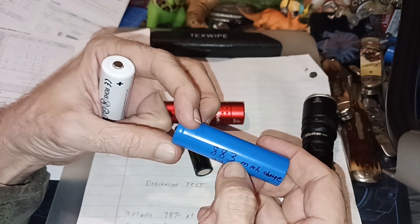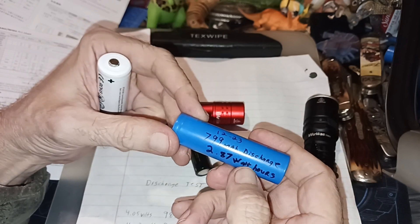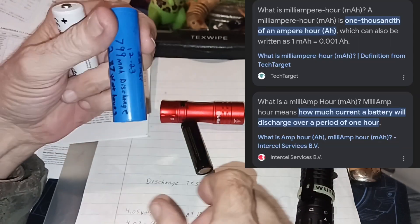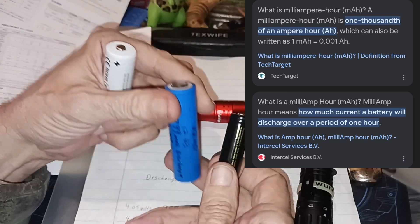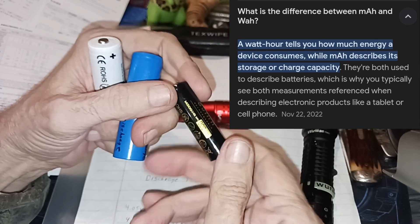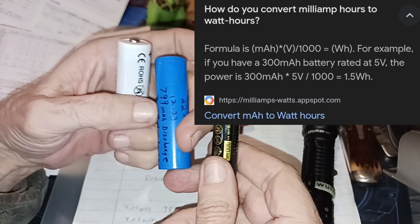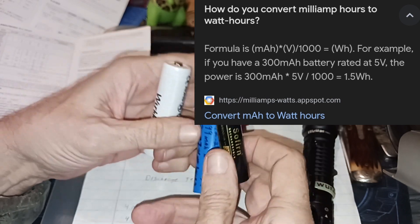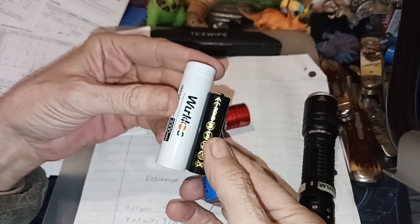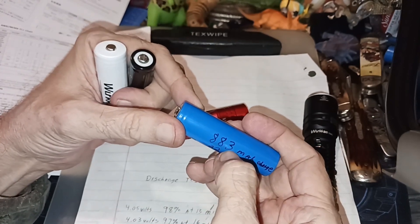What you're getting in reality on discharge is 799 milliamps. It took 883 milliamps to charge it, so you're getting 2.87 watt-hours. You're expecting this capacity and you're getting less than this — a 14500 that'll give you 900 milliamp hours. That's how they rip you off — call it shrinkflation, or just lying about the numbers. You have to test it.